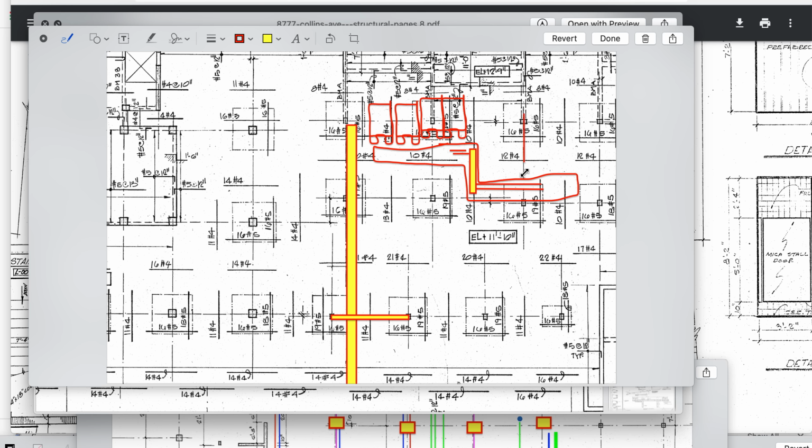And as you load this side here with foot traffic, it was only supposed to be about 40 pounds per square foot. So PSF, all right. Anyway, and then this was also supposed to be the same, 40 pounds, except for the vehicle loading, and you're going to exceed that when the car puts on brakes, if not just by dead load alone.